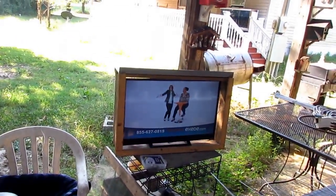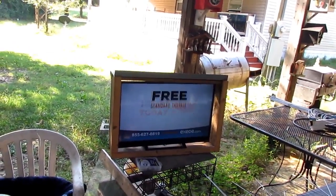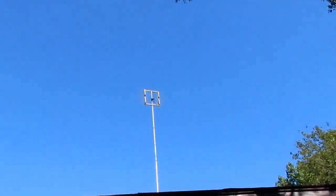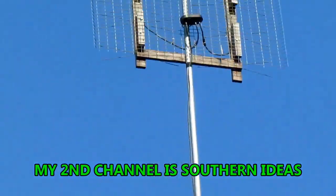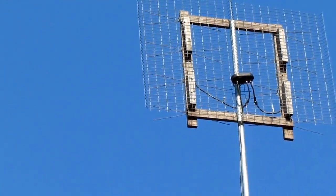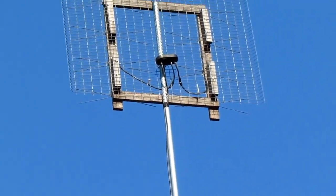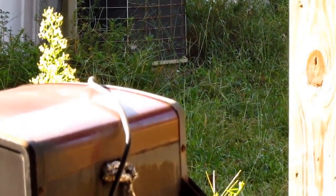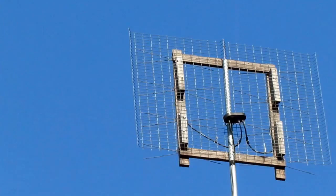Okay, here's my TV that I got out here under the shelter. That's also a smart TV — if you haven't got the internet, there's never any reason to get a smart TV. Let me show you the antenna I got up there. That's one of the first ones I made. That's a double antenna. It's got that RCA booster that I was talking about. On that double antenna, one side is on the UHF and one side's on the VHF. So that winds up working out pretty good.